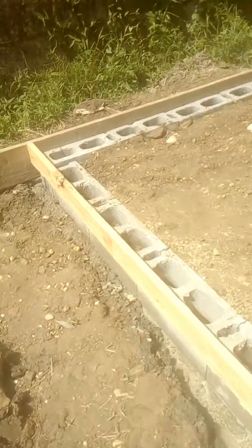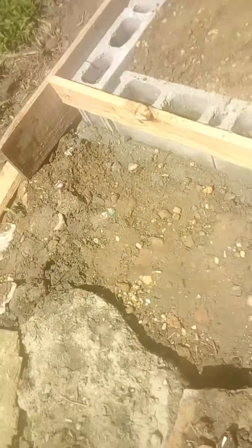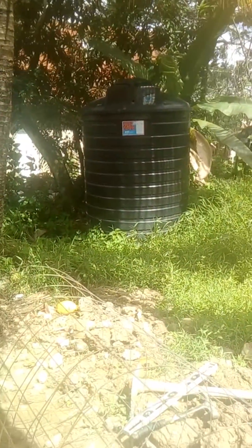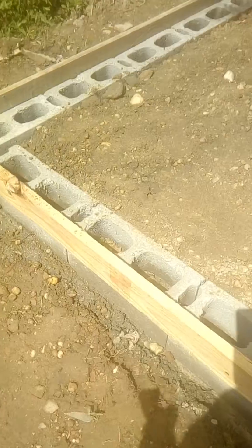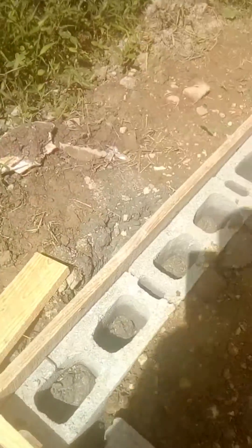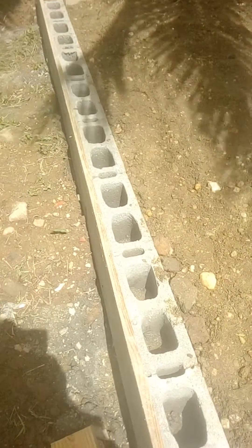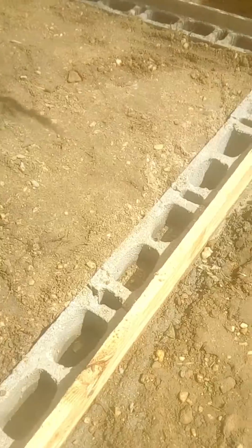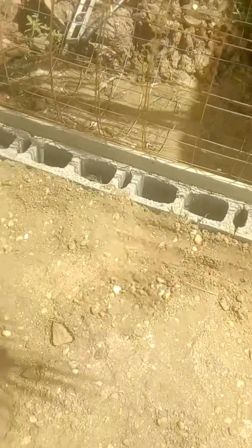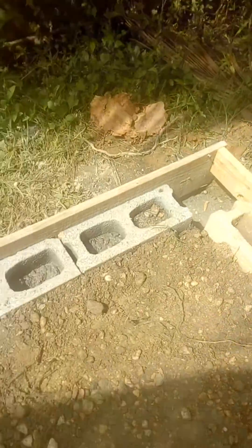Hello again, it's me. I'm on another small project — a tank stand to support two 800-gallon tanks. What I did was dig a trench eight inches deep, tie half-inch corrugated steel rods, and then on top I laid just one row of concrete blocks and backfilled it. I started yesterday, filled it this morning, and we're ready to pour cement on top of it.